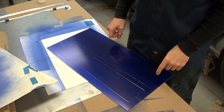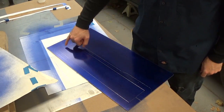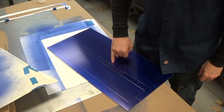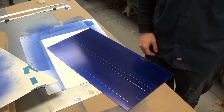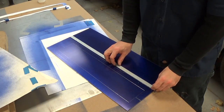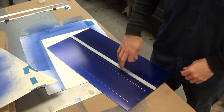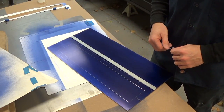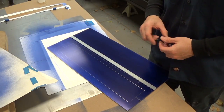Here's our laid-out two pieces. I laid it out so the bandsaw can run right through and break these two apart, and I'll scribe a straight line right through here. I like to leave leftovers with a nice straight edge, so I'll throw a square on there and put a line through so that piece will be good for something else later. I'm going to drill the holes first, because it's nice to have one contiguous piece rather than a little sliver flying around like a helicopter in the drill press.